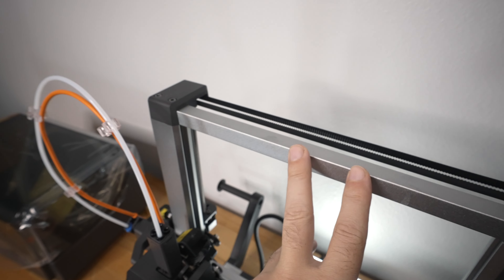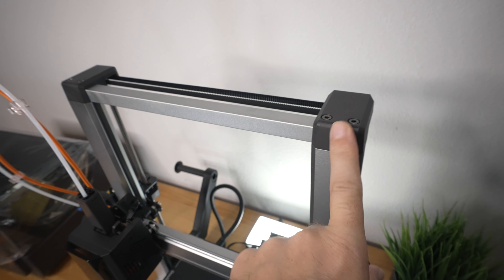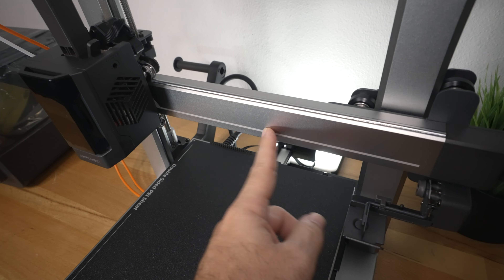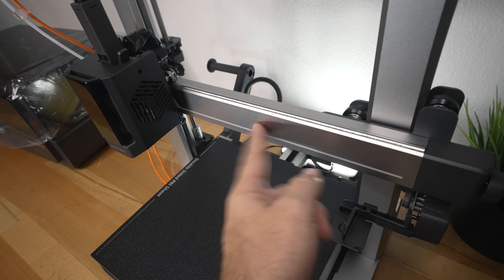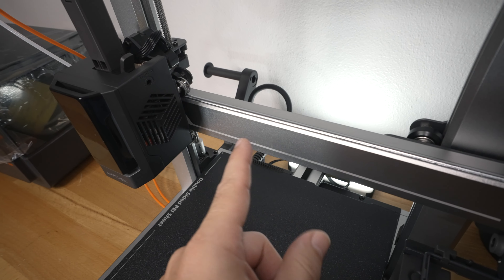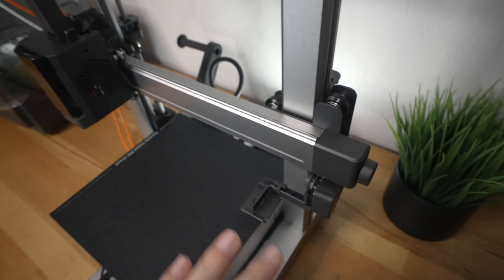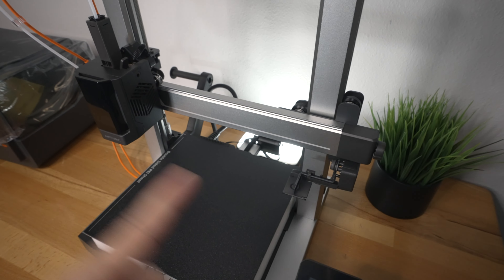Let's take a closer look at this combo. We can see metal with plastic ends — overall seems like a very good quality build. We can see the belt because our Z leads are dual and tethered. Our main X-axis is very nice and beefy. We got rail rod with metal rollers for the X, and for the Z we got the standard V-slots with plastic rollers, which is fine as it doesn't move up and down as much as it goes side to side.